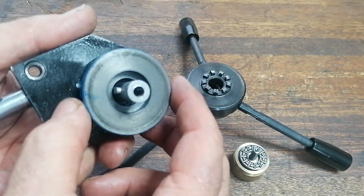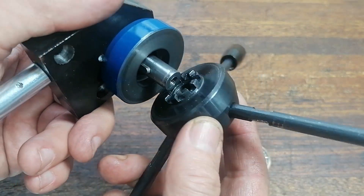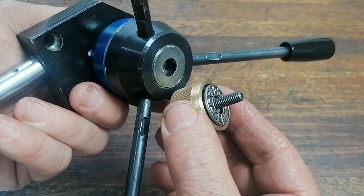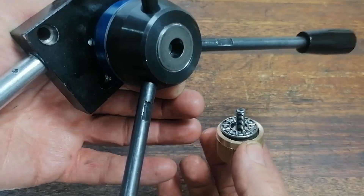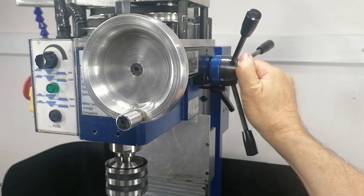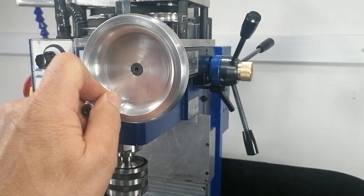My design used two flat surfaces — the hub of the downfeed wheel on one side and my custom clutch on the other. Add a thrust bearing and a brass thumb wheel and it works. Most of the time. But here's the catch: by hand, I can only tighten that thumb wheel so much.